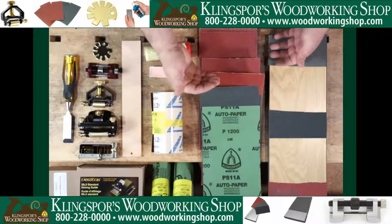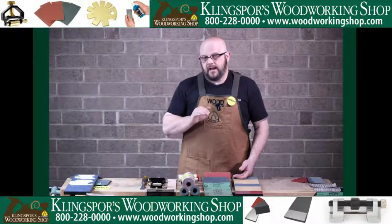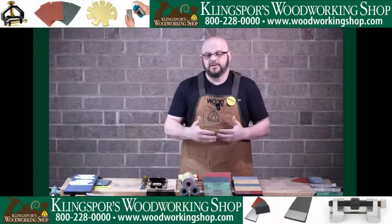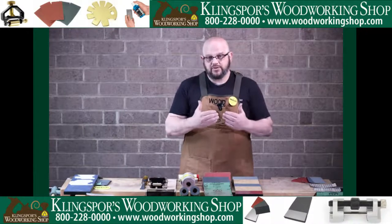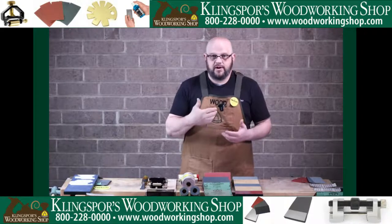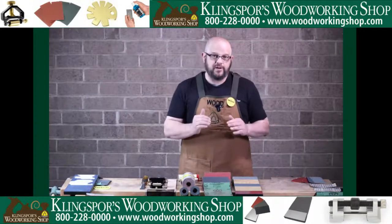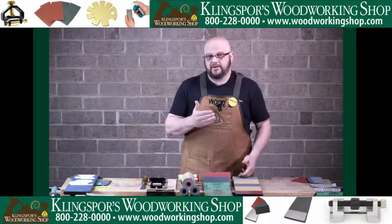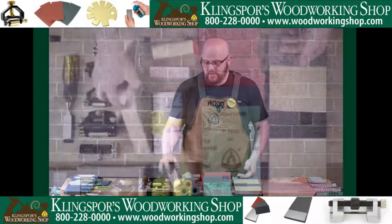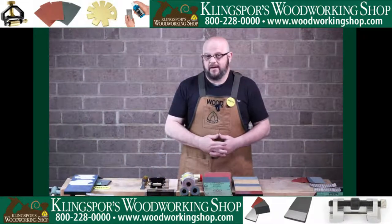The aluminum oxide is for your more aggressive range — shaping, really getting your chisel angled into whatever angle you want. If you're using a jig for repeatability, it allows you to get that tool shaped to your angle. You probably won't use much aluminum oxide once your tool is shaped. At that point, you're back to the 1,200, maybe the honing pad, the leather strop — just keeping your tool honed without much sharpening required.